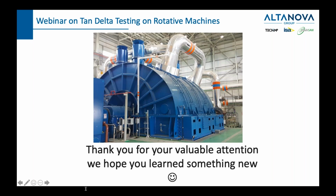The tan delta value can change if you are in a cold place or in a hot place? Yes, it can. Because the tan delta is also dependent on temperature, and we have a compensating factor which takes into account the temperature of the insulation. So yes, it can change.